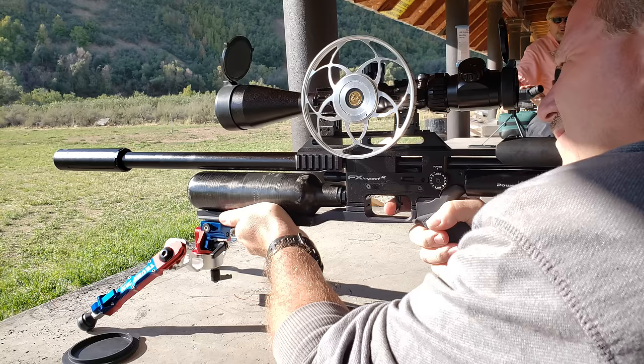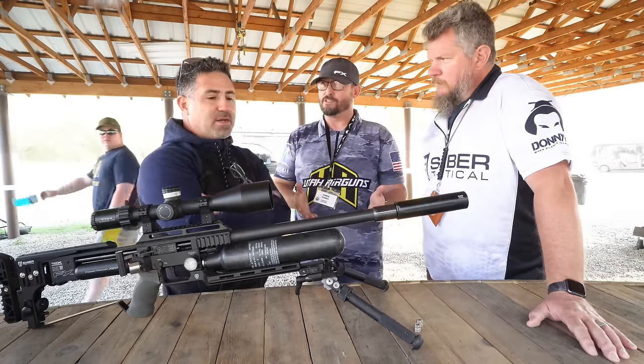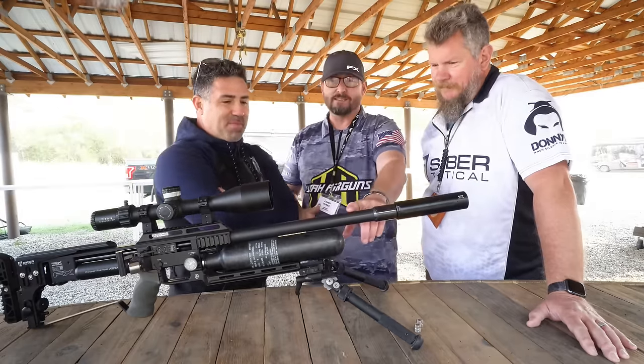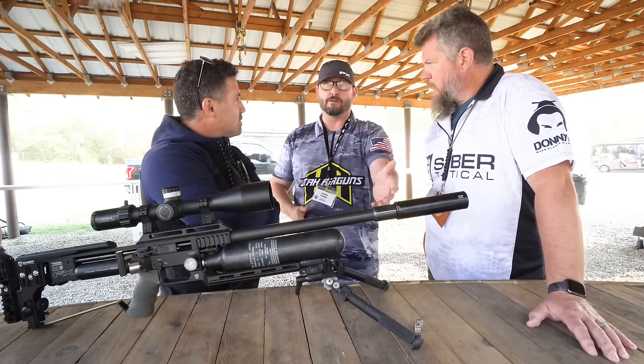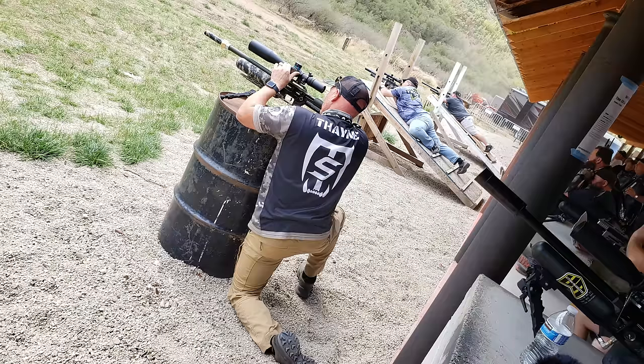In an aluminum shroud, right? So the thermal coefficient of aluminum is way higher than steel. Right? Well, guess what has one of the lowest thermal coefficients? Like a resin like that, probably? Carbon fiber. Yeah. So one of our big things is that as you sit out in competition, you're out at the range, let's say the sun is hitting one side of your barrel, and now we're talking real minute stuff.